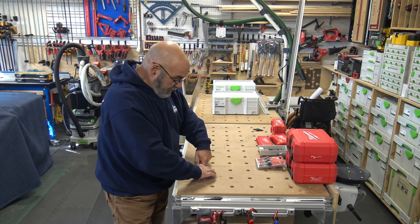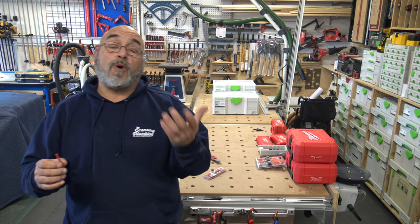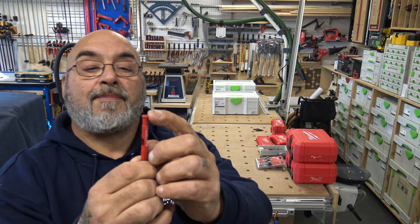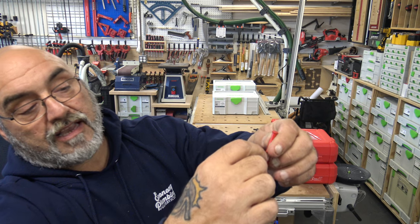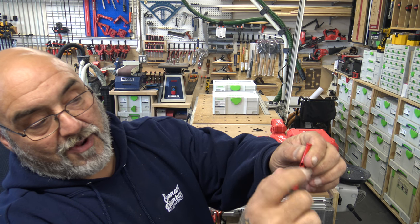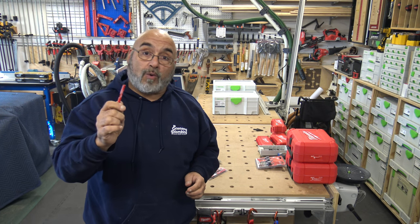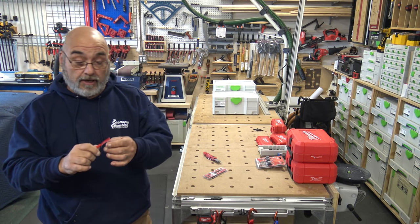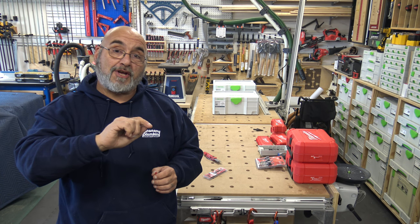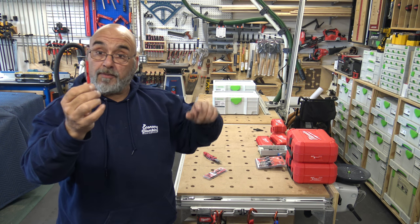These are tile bits — I find them really good for drilling through tile. This one's a quarter inch because that's mostly what we use for quarter-inch anchors. It has a diamond tip and a masonry section. You hit it with a little water, use something sharp to pick out what's in the center, and then drill again. They'll last at least 20 holes through good hard quarry tile. You have to start the hole with a masonry bit first. Home Depot sells them in the hammer drill bit aisle, up to three-quarter inch.